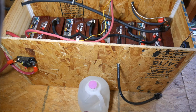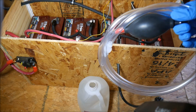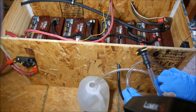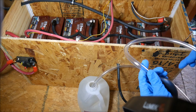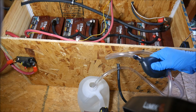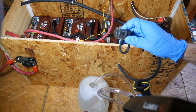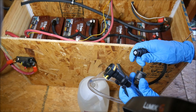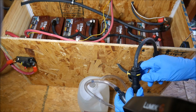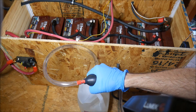We need to put our distilled water on the ground and open up the lid. Then we'll take our hand pump, put the end of it into the water, and prime the system by squeezing the pump. Next, we'll take the dust cap off the HydroLink system, remove the cap, and mate the end of the pump into the dust cap until it clicks. Then we'll use the pump and pump into the batteries.